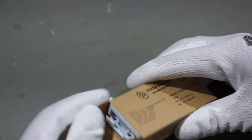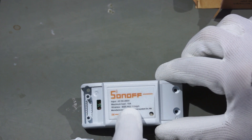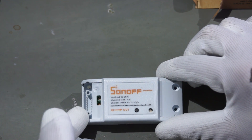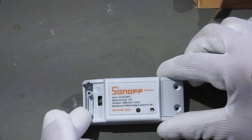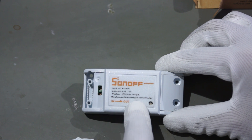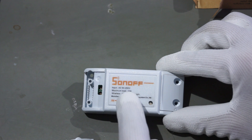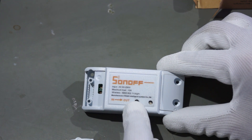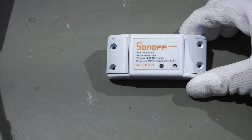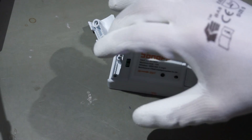This is a nice new device called Sonoff. It has an input and output, and in between there is an ESP8266 plus a relay, so you can switch 110, 220, or 240 volt mains. These Sonoffs come with custom firmware you can use with your iPhone, but of course I will program my own — with over-the-air updates, timers, and other features — and I have something in mind for the winter season, so stay tuned. The whole thing costs about $7, which is ridiculously cheap compared to buying an ESP8266 plus a relay separately, and it comes in a nice enclosure so it is safe to connect mains.